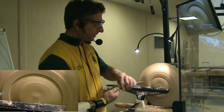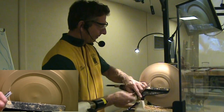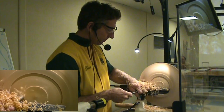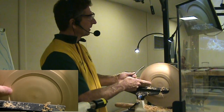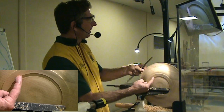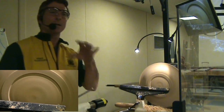In this scenario I'm going to use the traditional gouge. I used the fingernail gouge in here to make a little dovetail that will fit my chuck back in there. But the problem is it won't make that cut — it'll hit right there on that ridge. I'll take the traditional gouge and go right into the dead center. Run the bevel, look at the pigtail — that pigtail will tell you that you're always cutting clean, right through the dead center. When we go across that surface, there's not a whole lot of area that has to be sanded. Touch it up lightly with 120, 180, and you're good. I'm going to cut a little detail there that makes it look like an intentional detail rather than a chucking mark.